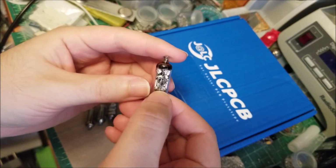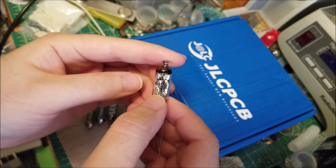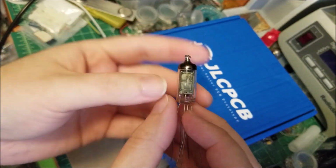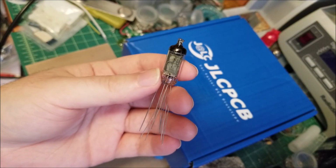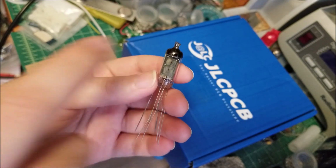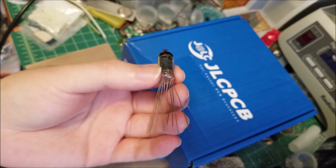So I ordered some more tubes, and these are IV-16. And you can see here they were manufactured the first month of '82. I guess first month or first week, maybe January or earlier in 1982. So these are not as old, but they're still really cool. They're 7-segment displays. They're basically 7 incandescent little filament type light bulbs all in the same package. And the filaments themselves are arranged in such a way that they form a 7-segment pattern.